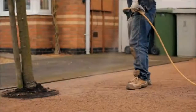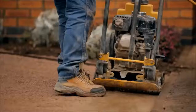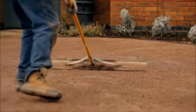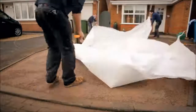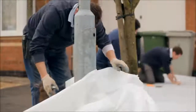Now wet down the area, then compact, starting around the perimeters and circling into the centre. Also scrape any ridges off that have been created by the compactor plate. Now install the weed membrane. This should be stretched out and fixed using 4 inch nails around the perimeters. Also trim around the perimeter edges.